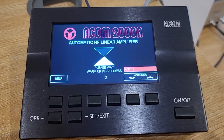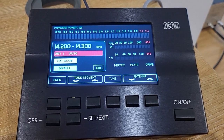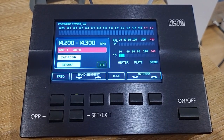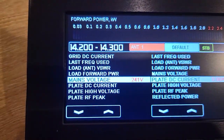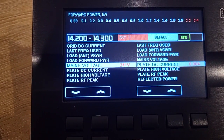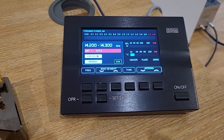Here we go, moment of truth. That looks like it's worked. You can see the mains voltage here is 241 volts, so it was right to change the tap — that should be down to the proper voltage now, it was too high before. Thanks for watching, we'll maybe post another video if there's any changes, but that looks like it's resolved the issue.